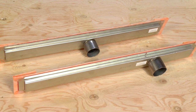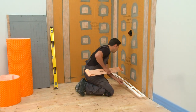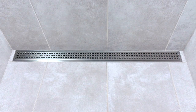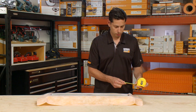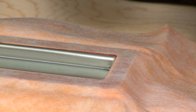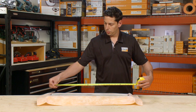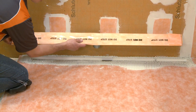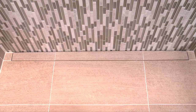The channel body is also offered with a center or off-center outlet. There are no hard and fast rules for choosing the channel body length. However, it is often desirable to select a length that nearly spans the width of the shower enclosure. It is essential to keep in mind that the bonding flange extends approximately one inch beyond the channel opening on all sides, and that the outside length of the channel body must fit within the inside dimensions of the shower space. Of course, tile format and layout must be considered as well.